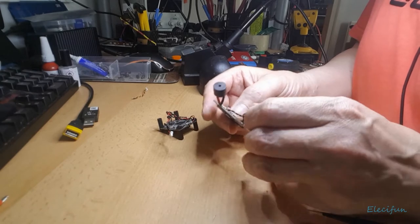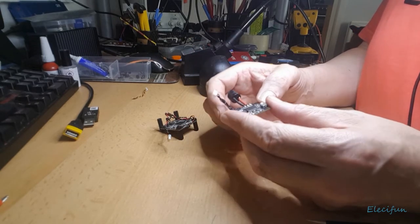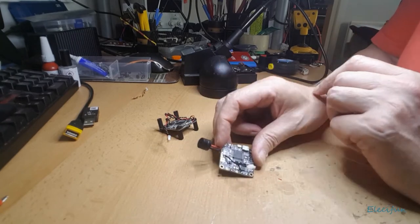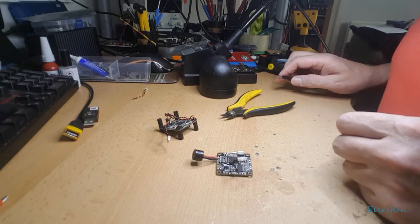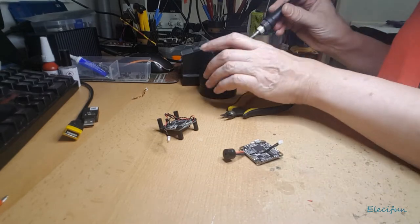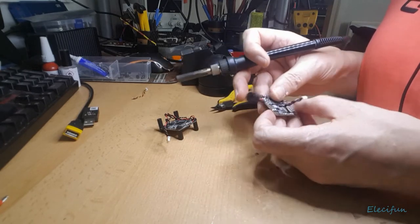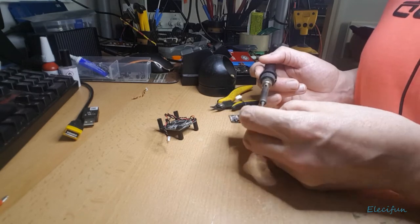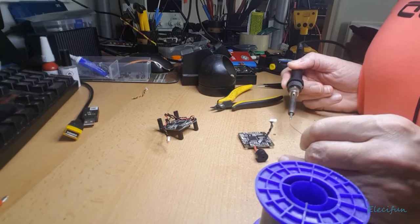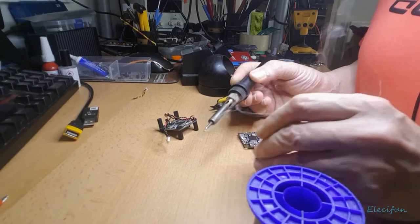Now the reason why I twist the cables together is because, especially on the power rails, so on your 5 volt here, there's going to be current flow, and when there's current flow through a cable, there's a magnetic field generated, and magnetic fields can be receivers of noise, and they can also transmit noise. So the way I look at it is, if you just twist things up as much as you can, wire is probably a bit too big, but if you just twist things up where you can, then you eliminate that magnetic field. One cancels out the other, as it were, when you twist them together. You must have heard this before, when it comes to things like networking and such, the twisted pair, twisted cables, how they use.